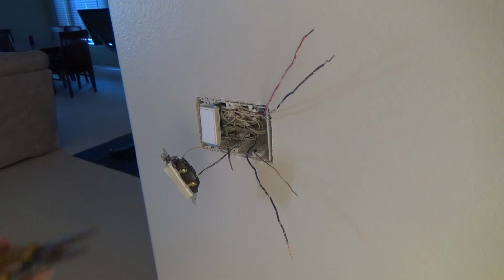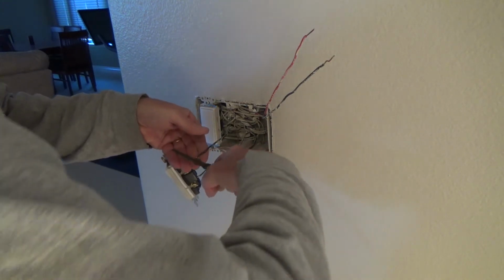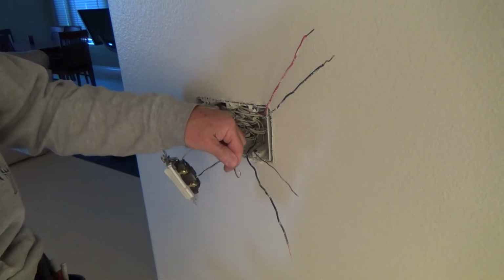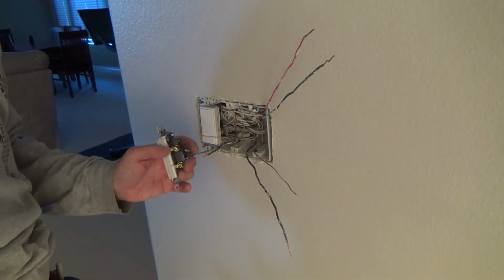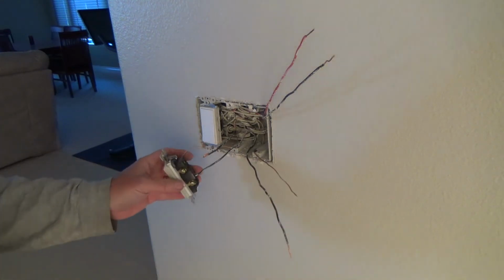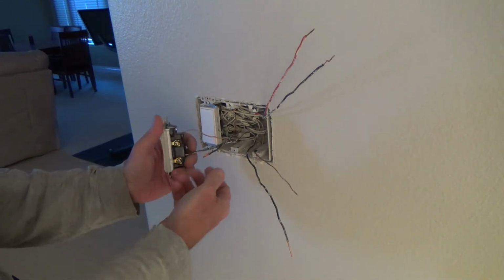And I can guess at it, or I can hold my tape measure up there. That's right at 1 inch. And I'm going to take my hook, put that in there, about 1/8 of an inch, and turn that up. Boom, like that. See there? That's what I want. And I'm going to undo the side screw. You can loosen it up just about all the way until you start feeling it tight. You can't just undo the screw. I mean, you can if you really crank on it at that point.